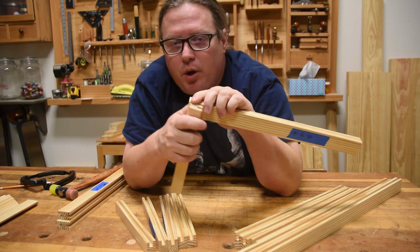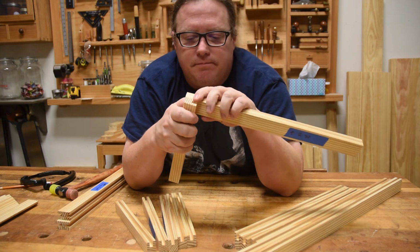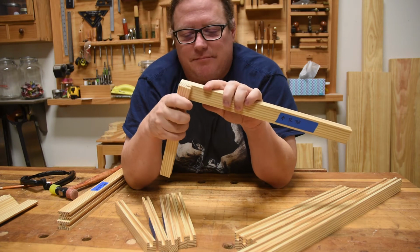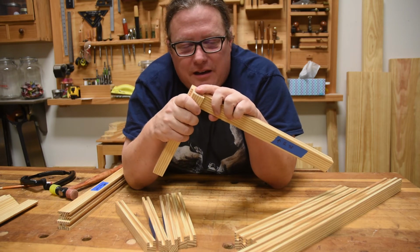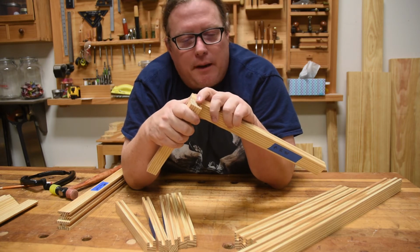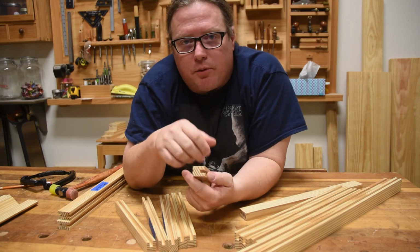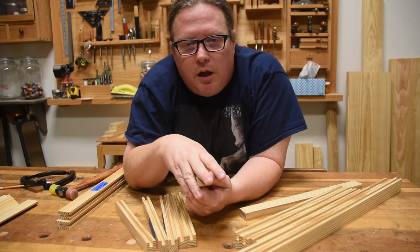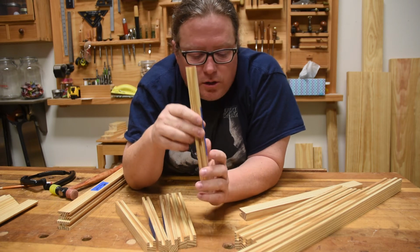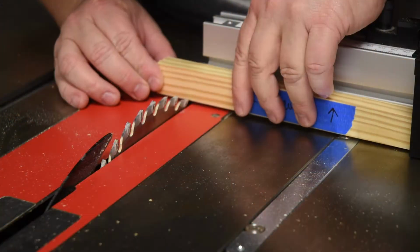And once again, you could put it into the frame and measure it out pretty closely. But because we're not going the long distance, I think you can have a little wiggle room with a little bit of compression, since this is also long grain. So I'm going to just cut these out using either a marking gauge or the table saw. Probably the table saw, because I want to play around with that one. But all we're doing is a finger joint, where the short pieces are going to be the tenon that come up inside the groove of the long pieces.